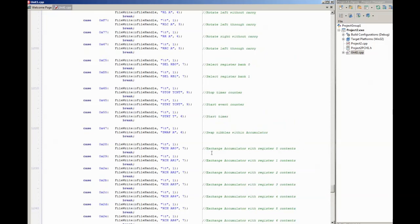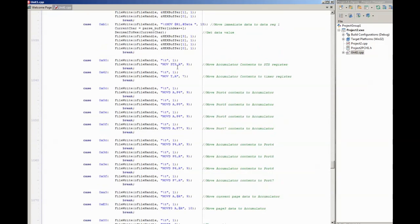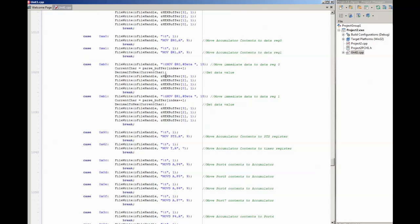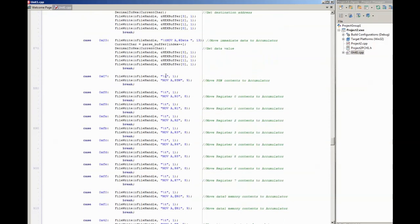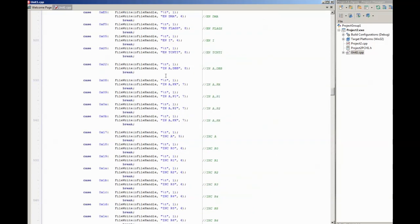What I will probably do, as I said, is make an initial run, so make it a two pass thing, and it's a very similar idea to this. It just looks for instructions where a jump occurs, and we'll probably just create a table of those, and then in this part of the code it will just look into that table, and if the instruction in the particular line that's being processed requires a label, then it will insert the label first. If the address that's been calculated is in the table, then it will convert that into a label as well. So a very simple disassembler. It seems to work very well, and the output it's giving seems to be far more realistic, and it does seem to actually work, whereas the one I had from the disassembler I downloaded doesn't seem to work correctly.